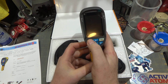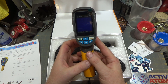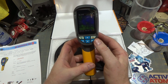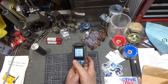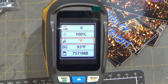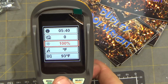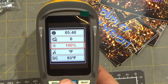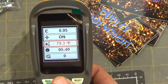To turn it on you push and hold the menu button, and that's also how you turn it off. You have to set the average ambient temperature or it confuses the device, because that sets the center range. In the menu, first is your Fahrenheit/Celsius choice. Then there's the backlight setting, which defaults to 10 percent — I assume that's for battery life because this thing eats batteries. They claim six hours but my rechargeable nickel metal hydrides are getting maybe an hour. You can also view the number of photos, preview photos, and set the time of day and ambient temperature.